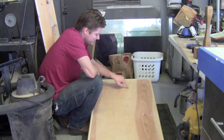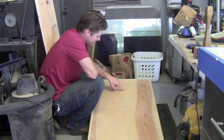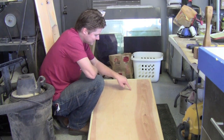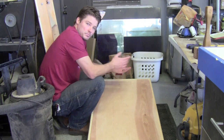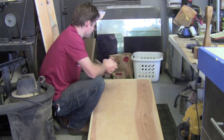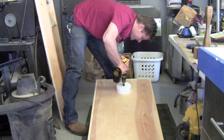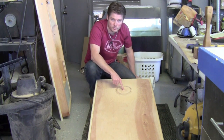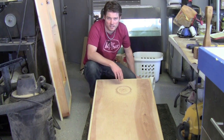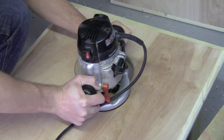Now it's time to cut the actual hole for the corn bags to go through. Regulations say that from the top it should be nine inches down and twelve inches from the side — I've made a cross right where I need to drill, and it needs to be a six inch diameter hole. Six inches is pretty big and most people would want to just cut it with a jigsaw, but if you're not very steady it might not look great. If you have the money, you can spring forty dollars for a six inch hole cutter saw. I'm only going to go deep enough where the center drill bit goes through the other side, because if I keep going it's going to splinter out the bottom. That thin veneer is very fragile, so we're just going to flip it over and continue the cut through the back — then whenever it's done it'll be a nice clean hole that I can round over with the router.